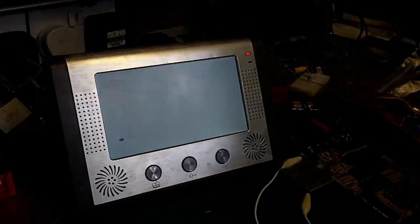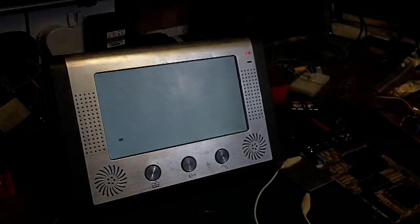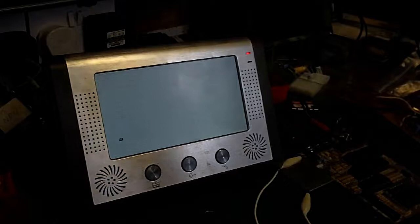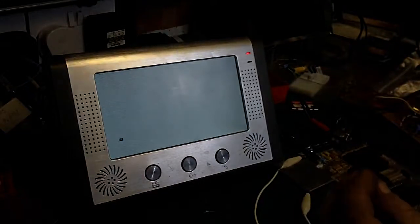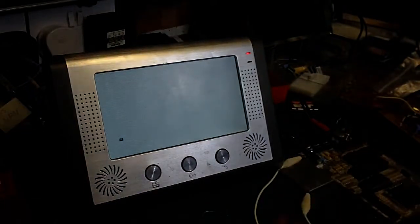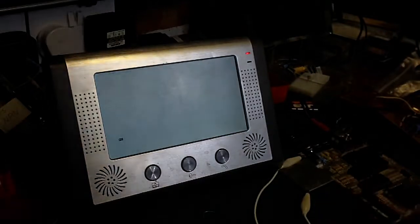Unfortunately, I've not found one yet that would work with the Forth that I plan to run on this thing. But for basic programs, I've found two possibilities. One's a little interface you can build for this, which will allow it to work with a Commodore 64 or VIC-20 disk drive. If you know the C64 and the VIC-20 disk drives, they basically run on a serial protocol, so apparently it's not too much trouble to build an interface for this to allow it to talk to one of those disk drives. I believe it involves a replacement of the ROM and a few other little things you need to do, but apparently that is a certain possibility and something I'm going to look into for this project.